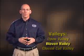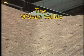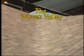First, we'll look at the woven valley. This is the weakest valley and should only be used with 3-tab shingles. This technique should not be used with GAF ELK laminated shingles because of their thickness. So we'll install a woven valley with 3-tab shingles. Remember, valleys are a prime leak area, so it's important to be extra careful.